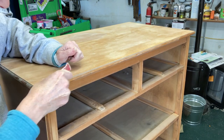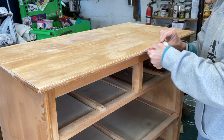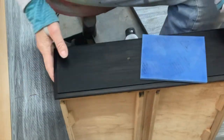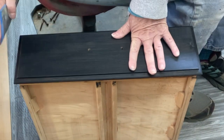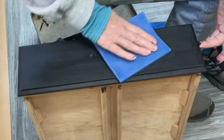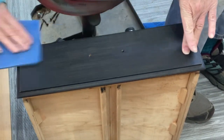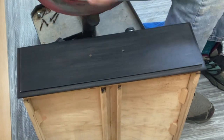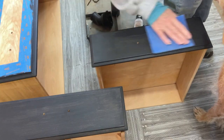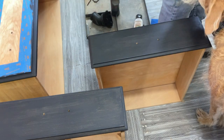Just like the drawers, I wanted to paint the edges here, but I needed to get a scuffed surface, so I really sanded it like crazy. It took a while, but it worked nicely and I got a nice smooth finish. I used finishing pads on the painted surfaces — they are very fine. The last one I used is kind of like leather; there really isn't much grit to it, but it's nice to buff it out, especially on black, because it shows everything.